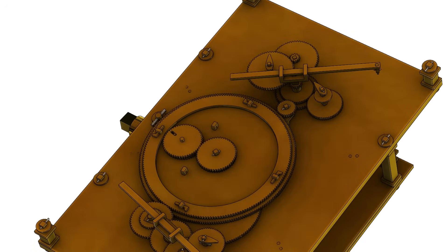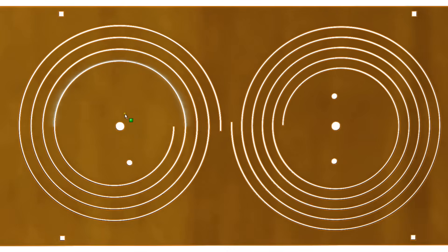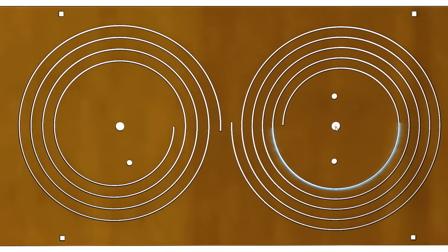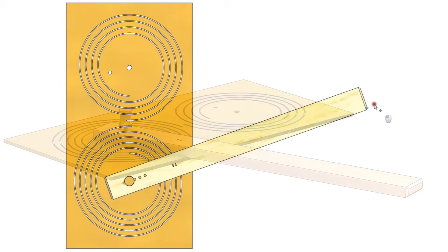But the spiral grooves on the rear dial of the mechanism suggest another possibility. The slot is approximately 1mm wide, and what initially appears to be a true spiral is in fact a collection of half circles. In the orientation shown on screen, the upper half of curves on the Saros spiral are centred on this hole, but the lower curves are constructed from a point just a little to the side. And something similar applies to the metonic spiral — the top curves are constructed off center, and the lower curves are constructed from the hole at the center of the spiral. The individual arcs are not obviously suited to formation on a lathe, and would have been extremely tedious to form with files or a saw. But they are well suited to some sort of geometric construction, with arcs of known radii struck from centers a known distance apart.